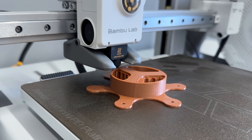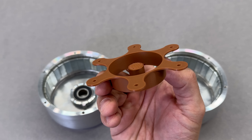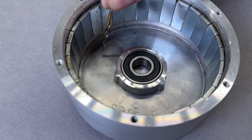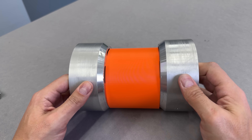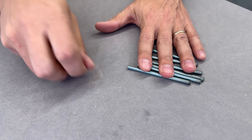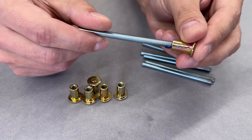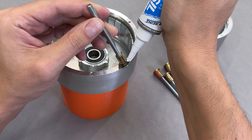I'm no longer sketching out templates on paper or, as in this case, spending forever measuring and marking drill holes. Now it's just a quick 5-minute model in Fusion and straight to the printer — insanely precise, super quick, and way less hassle. Speaking of hassle, I couldn't find long M6 bolts with ultra-low heads, so I made my own from M6 threaded rods and furniture connector nuts. A drop of blue thread locker keeps the nuts in place and turns them into functional bolts. Six attempts later, the hardware was ready.